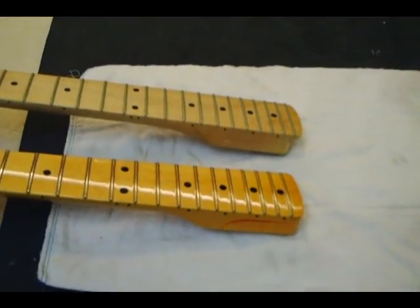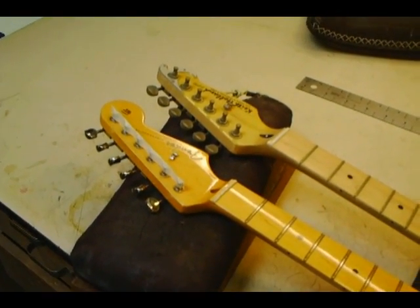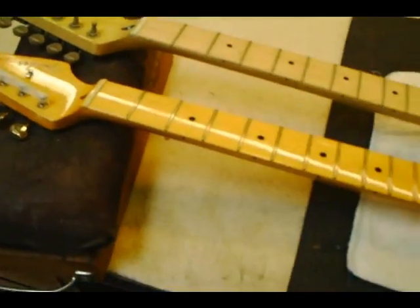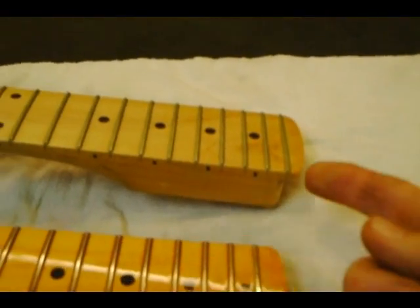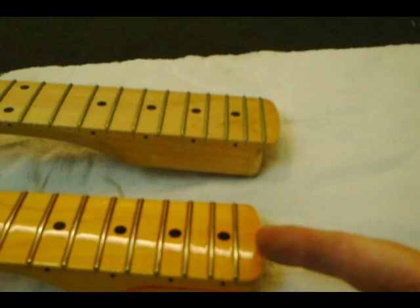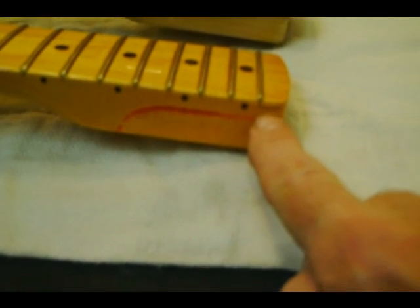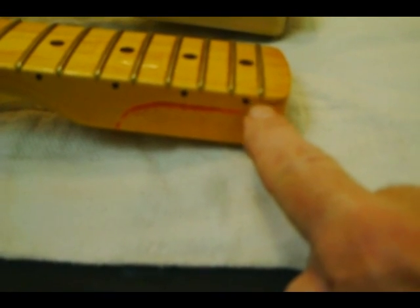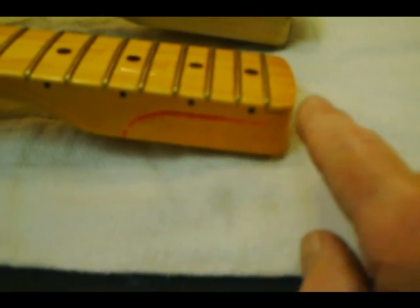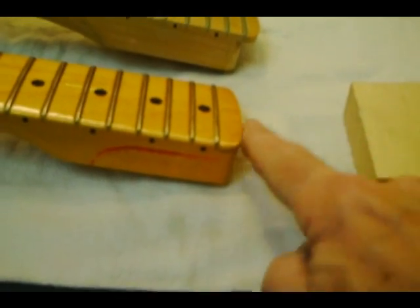So let's take a look at these two necks that are on my bench here. One's one of my necks that I put on my custom guitars and the other one is the Fender reissue neck. If you look down here, you'll see that overlap there — that is the 22nd fret. This one just has 21 frets and it stops right here. You can see that pencil mark there. I'm going to take that fret out, cut down right there, and inlay a piece of maple right on top of that. I have my piece of maple here that I'm going to cut my 22nd fret overlap from.